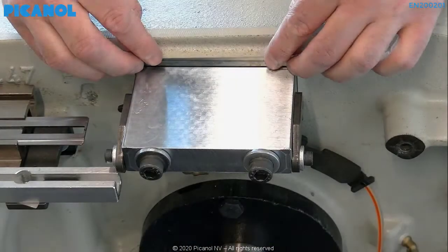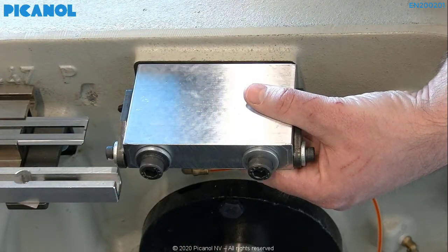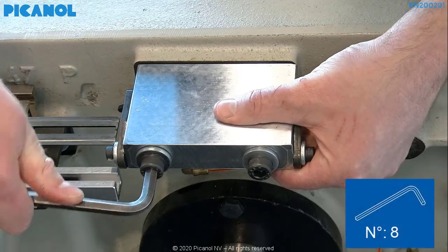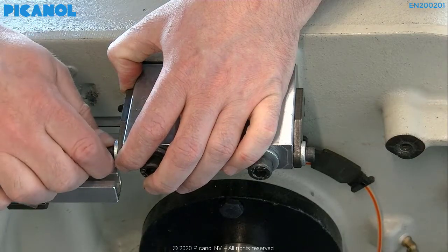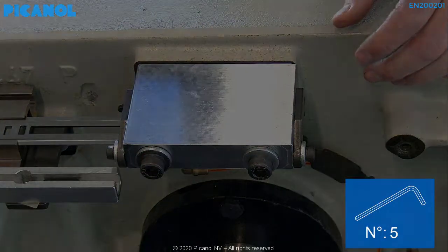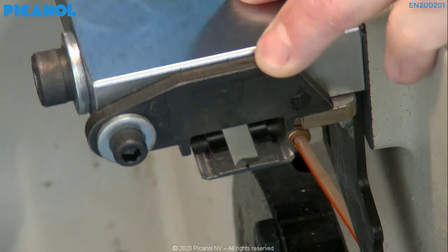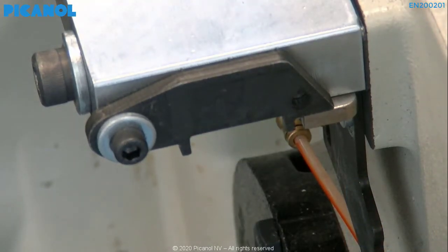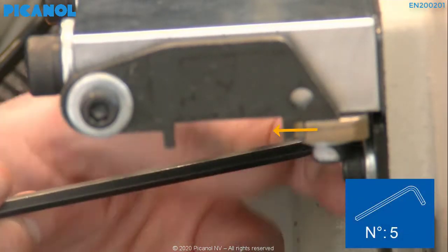Next, we are going to do the same procedure for the top cooling block. Don't forget to place exactly the same amount of thickness plates as the bottom cooling block. Place the cooling block a bit up so the gauge can move through the terminal pieces, and just hand tighten. Enter the gauge into the front terminal piece and make sure that the gauge is placed in the center by shifting the terminal piece into its correct position. Hand tighten the terminal piece and check again. Do the same procedure for the back terminal piece. Moving the gauge in and out should be smooth and the caliber should not hit anything. Loosen the side guides on the back and push them against the stoppers of the terminal pieces, and tighten the bolts.